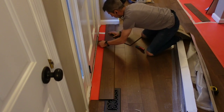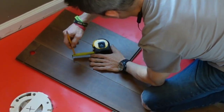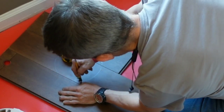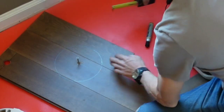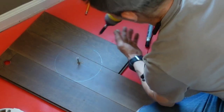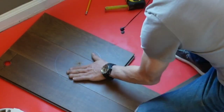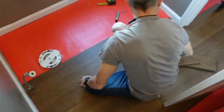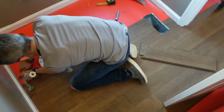I do have a quick tip from TikTok: a good way to find the center of the toilet hole is to put a piece of tape over it and measure three and a half inches from both sides to the center. On TikTok, if you find that center on your three boards and put them together, you can drive a screw through there, pull your tape measure out to three and five-eighths inches, lock it in, and take a pencil and just swivel it around. It is dead accurate and makes short work of cutting toilet holes.